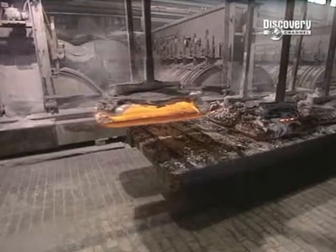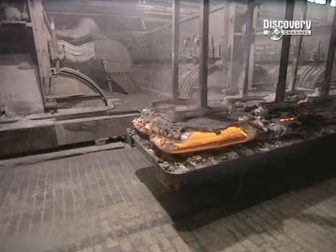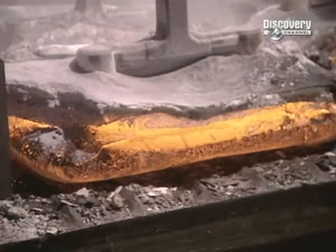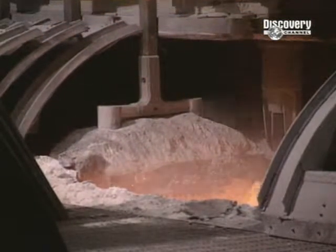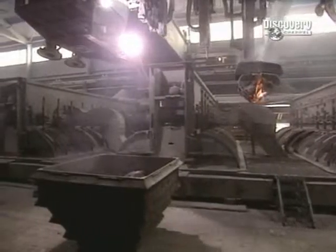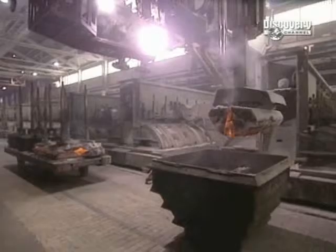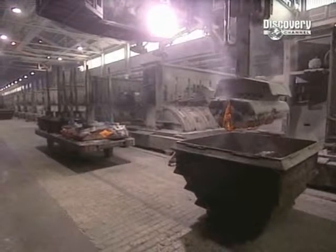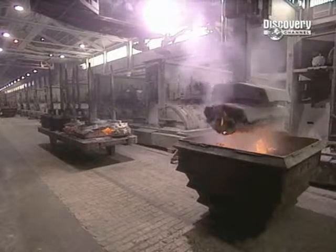They clean the rods, which will then be reused. When the electrodes are replaced, the accumulated impurities that form as a crust have to be recovered from the top of the pots. This is done with pincers. Then a new electrode is inserted into the alumina and electrolysis continues.